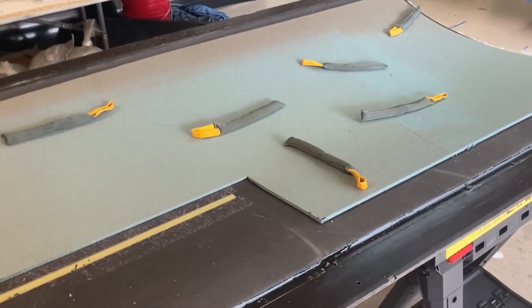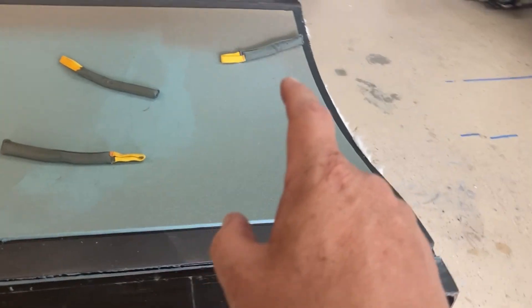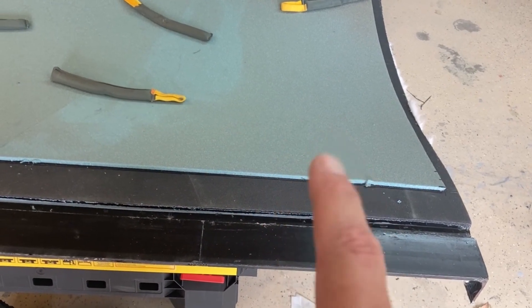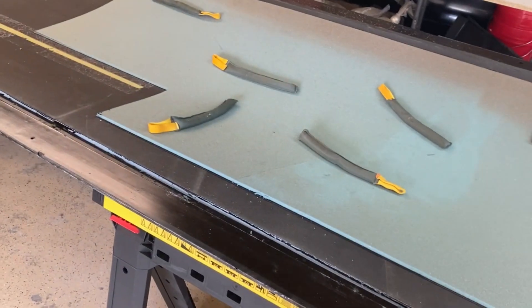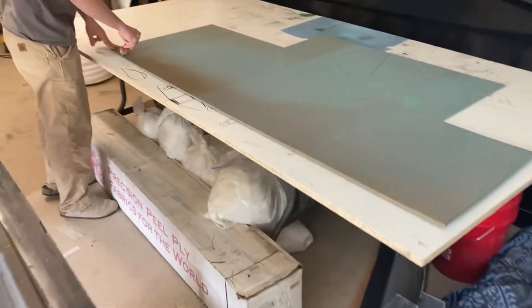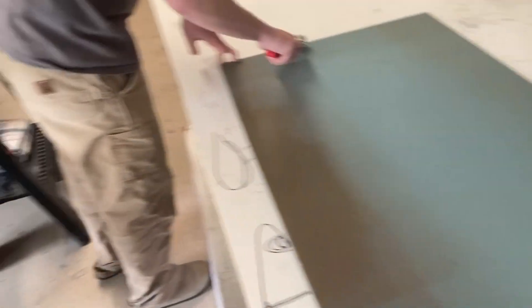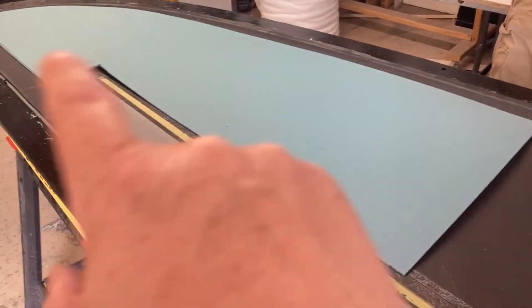Getting started on fitting the core now. This is quarter-inch thick three-pound Divinycell and it'll go all the way to the tip, and the aileron will be a separate piece. About 11 inches wide from the spar back gets cut out — because that's where my butt's going to go — and I want the inner and outer layers of carbon to touch with no exposed foam. Ryan's perforating the core using a model airplane tool called a woodpecker, which puts a bunch of little holes everywhere to help with adhesion. After that I'll sand all the bevels in along the perimeter of each piece.